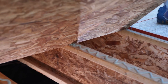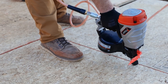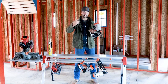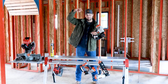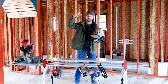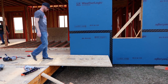We didn't use just a regular nail — we used the Paslode Tetra Grip nailer. I'm going to do a whole video just on this gun because I think it's that cool. It shoots a nail that has helices on it and it spins like a screw, getting nearly three — maybe a little over three — turns per nail as it goes in. So it screws itself into the floor and creates a super stiff subfloor.